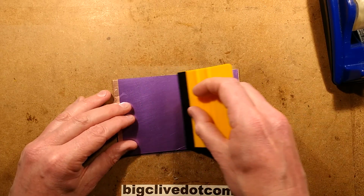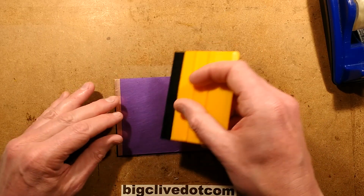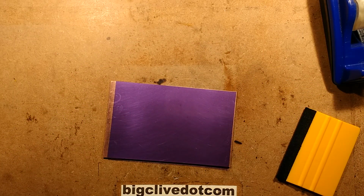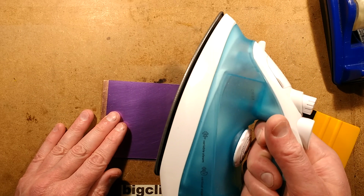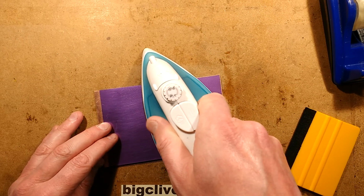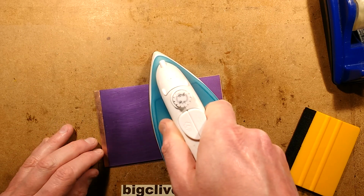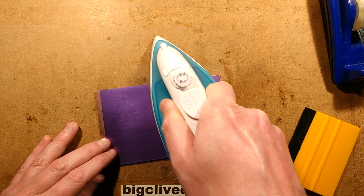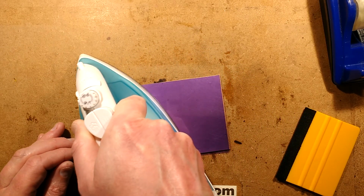And previously I've used a hairdryer to actually cure this, because you want to heat it to put it on. I should be watching my time here because I don't want to expose this to the LED lights too much. This time I'm using a standard domestic iron. There's not many uses for these other than this, because I certainly don't use it on my clothing. So use it to firmly iron that material on. And what that'll do is fuse the material onto the circuit board.